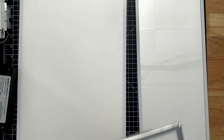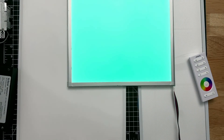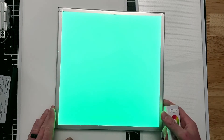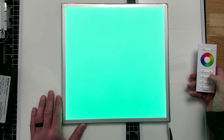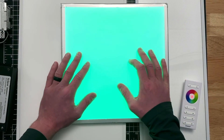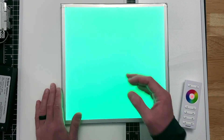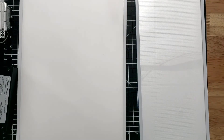I'll also demo the RGB and RGBW panels and show you why I love RGBW versus RGB. You'll notice it's a slightly thicker panel because of the RGB or RGBW tape light inside. There may be some flickering over the camera, but it does not flicker in person. You can change different colors, and with RGBW you can even add or remove white — for a deep color, I actually want to take the white out, since mixing white in will desaturate it and prevent that blue or green or red from popping. With RGB alone, you don't have that option.